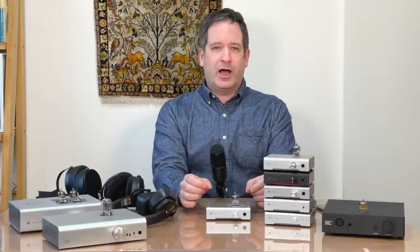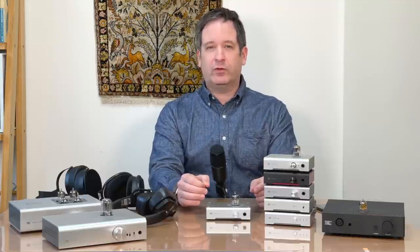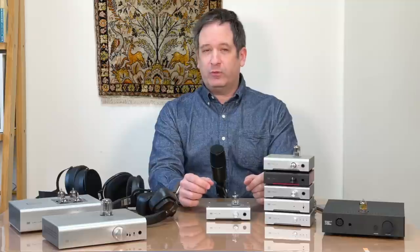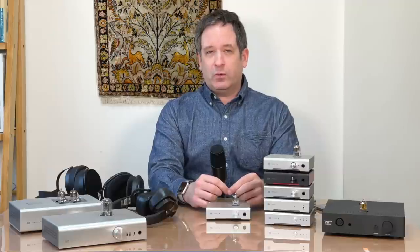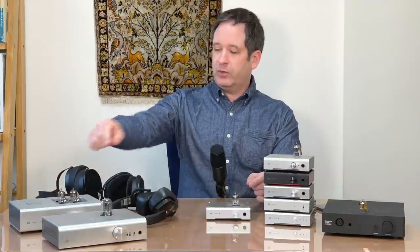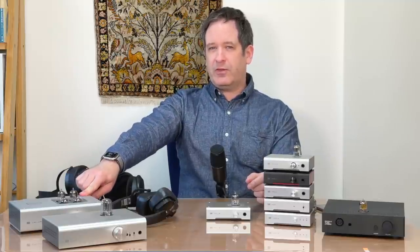Let's get an overview of what tube amps are. When you have some kind of amplifier, whether it be a headphone amp or a speaker amp, there are usually multiple gain stages. The main two types of gain employed in amplifiers are voltage gain and current gain. Tubes are good at voltage gain, which is why you often see them in amps — they're used to basically increase the voltage. Solid state circuits are good at current gain. The most basic kind of tube amp in the headphone world is called an output transformer-less amp. That's what the Valhalla 2 is — the tubes are used to increase the voltage, but there's nothing there to increase the current.